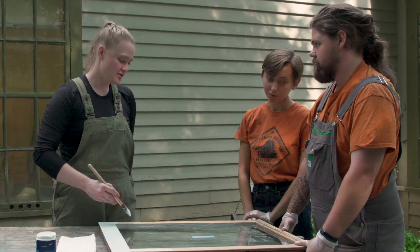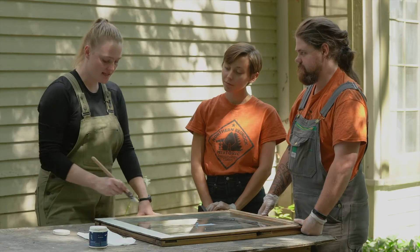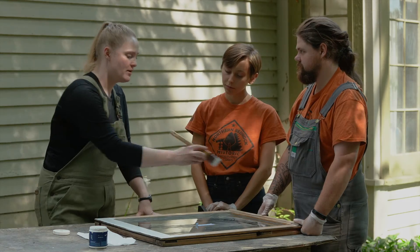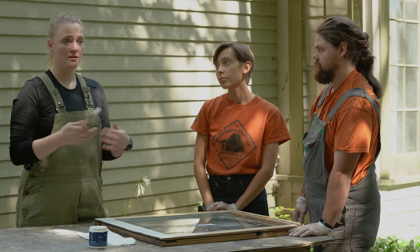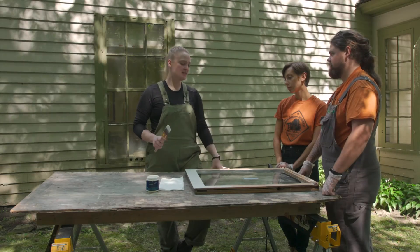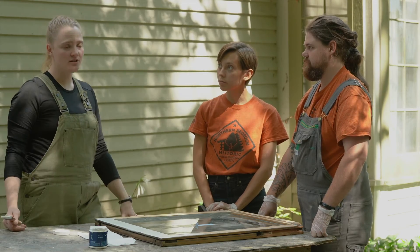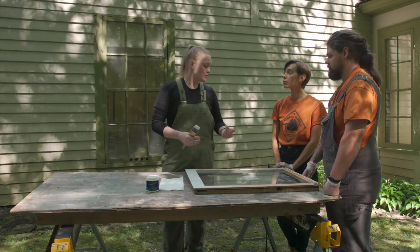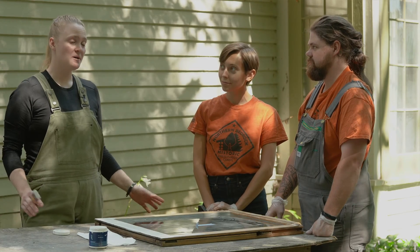We're going to finish doing all of the wood elements I mentioned — paint the glazing and a little bit onto the glass all the way around, finish that coat, and let it dry. You then add two more top coats after that and your sash should be painted. Once fully painted, you can spot paint over time, and I think that's what homeowners and building owners can forget — it's those little bits of maintenance that will really save you from having to go through a full restoration process again. Stay tuned; the next video will be about epoxy repairs.